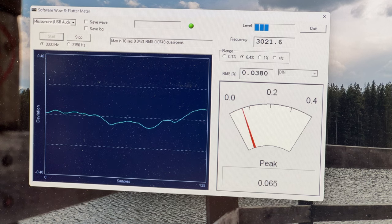I decided not to recap the meter board because it's full of bipolar caps and I'm not sure if I've even got them, so I can always do that another time if I need to. That's the only board left with the original capacitors. So let's see if we get some audio. Sure sounds like it does audio. Not sure if the EQ is right yet, but we'll determine that as time goes by.